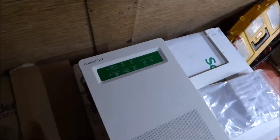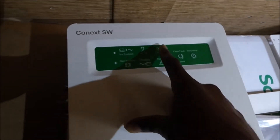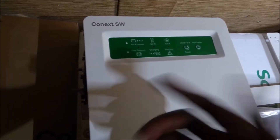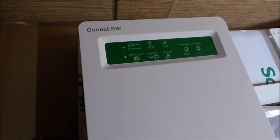Very simple. On the front there is nothing — just display lights, or what I call idiot lights, that tell you what's going on: if it's charging, if you have AC in, if there's a fault, a blinking light. This unit also has generator support — a very high-priced inverter feature — which allows you to use your battery to power items it ordinarily would not power.